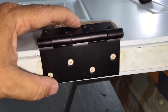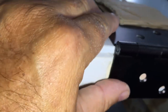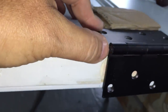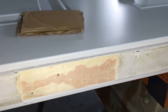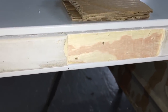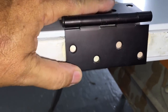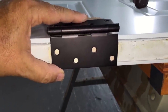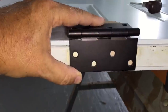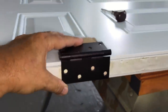My hinge is upside down. If I leave the hinge this way, with this being the top, the rain is going to go right down into that pin hole and rust the hinge. Boy, it pays to think ahead — which I didn't this time. These are the little mistakes you make when you're not an expert, just a guy with tools who likes to do things. They're just little pilot holes, so I'm going to re-drill them and it'll be alright.